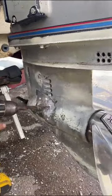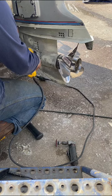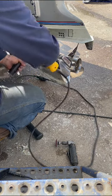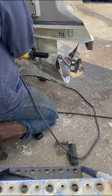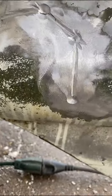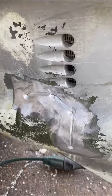Next I'm going to gouge the crack line. So that's your valley right there — I opened it up so I have something to lay rod in, and it gives a little bit better penetration, better hold. I'm going to have to flush this again and spray some chemical on it, because if you look right here you can see some of that oil still flushing through. That's not okay — that makes for dirty welds and those are never fun.